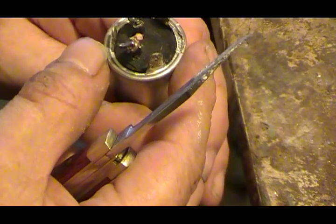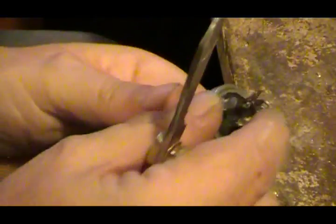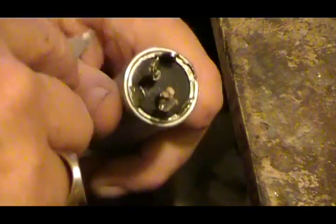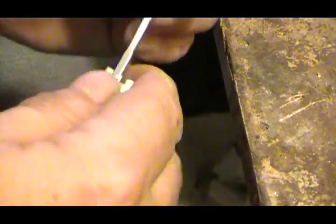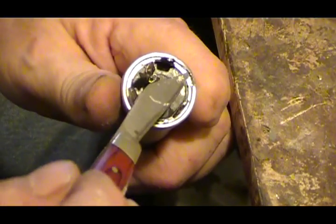I've gotten it started — this is a tough one. A lot of these smaller ones are. This is the only one I actually had that was easily able to get out of a radio. But generally, you just take a knife and just dig in there. I usually like to let this ledge sit against here, because you don't want to do it like this — you could get yourself in trouble if you slipped. This way, if it slips, it'll just hit the table. And the other thing too: it's a regular pocket knife, so always be putting pressure this way, because if you don't, you could just close her up on your fingers. So you just dig in there between the metal ring and the aluminum.